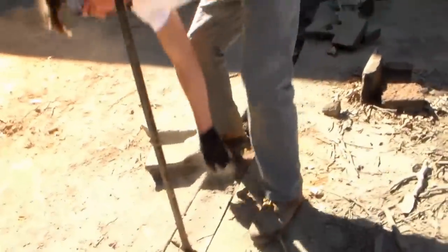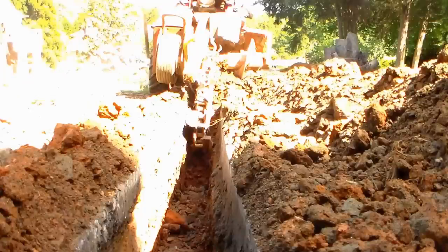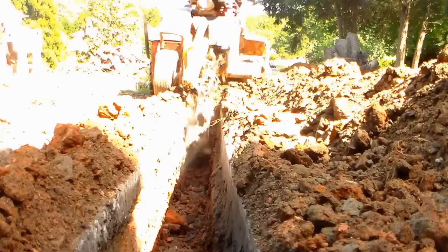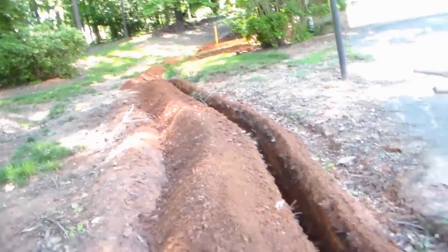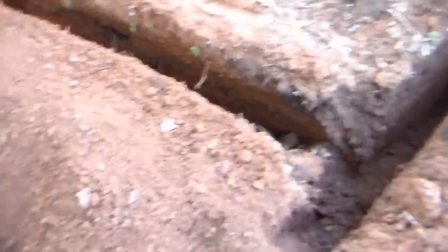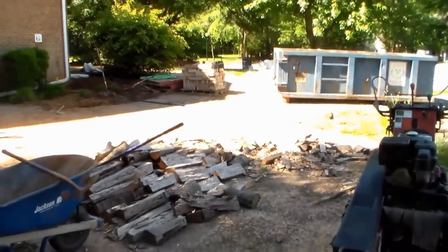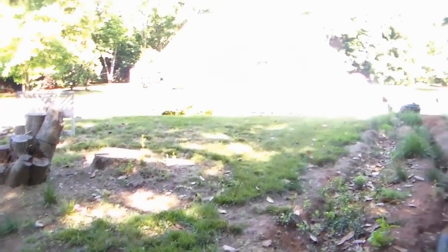We'll just throw all this asphalt right over here in the dumpster. Trenching across the driveway, whether it's asphalt or concrete, really doesn't make any difference — it's the same as trenching in the yard. The difference is you need to keep your trencher running very straight. We've got the main portion of our trench dug. You can see it runs all the way back around behind the house there to the patio. We're coming down, making a turn, going right alongside the driveway. We have to be really deep here. We'll connect where Paul cut across there, hook up that front downspout, go around these trees, then go on out to the street.